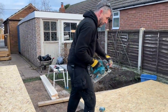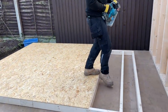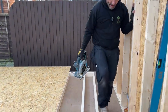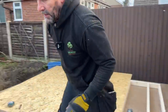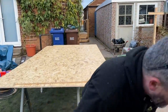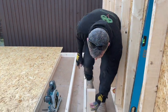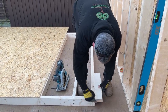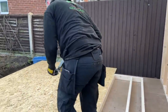Both boards are on, the wall's nice and square. What I need to do now is cut this rip — my right angle will be the machine edge. I'm going to let it fly over 90mm, and the reason is: that's this wall going one way, so that's that wall going the other way — that's why I'm letting it hang over 90mm, so you can fix to this wall here.